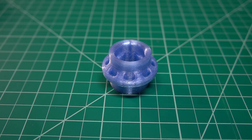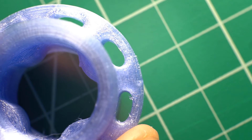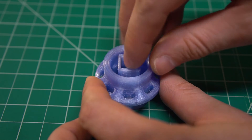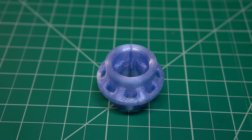For version 6, I switched over to a PETG that historically has behaved better for me, and I continued to dial in my print settings. In this version, I added a custom support structure that gives the bearing seat surface something to bridge to, and it works perfectly. That face is now as clean and precise as I think it could be, and the support box pops right out when the print is done — no tune-up needed.